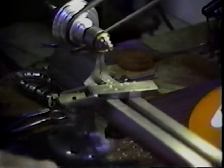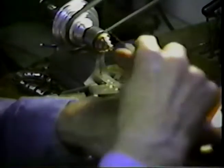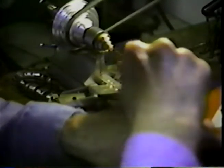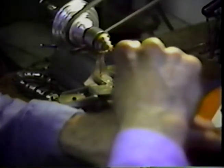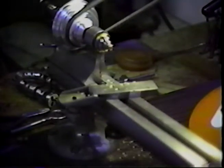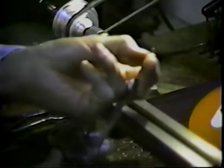Probably drilling this hole is the most difficult thing in making the nut. We want to continue until approximately two nut-thicknesses deep. Setting the thumb against it, we have about a quarter of an inch of depth. Let's call that sufficient.